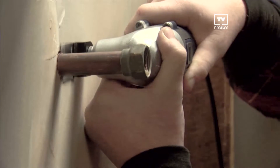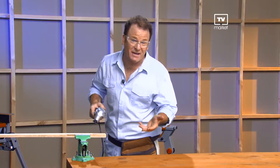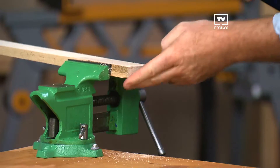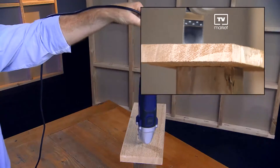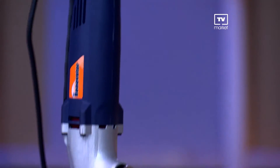And it's not just nails. You can cut old pipes or new ones just as easily. Imagine trying this with a hacksaw. The Renovator does this kind of hard work for you. With the same e-blade attachment that just cut the metal, you can now cut wood with ease. And it makes a nice smooth cut without the rough edge you can get from a skill saw or a sabre saw. The oscillating action is the reason why. You wouldn't try this with any other reciprocating or spinning tool. The Renovator is doing all the work — I'm just lowering it into the wood.